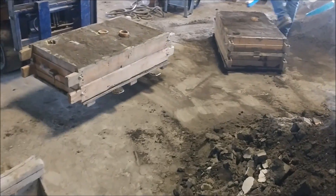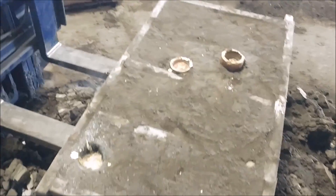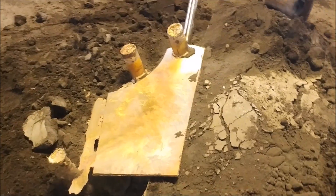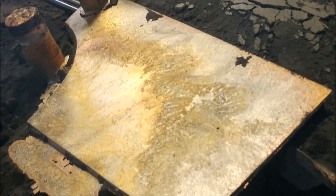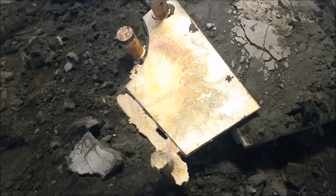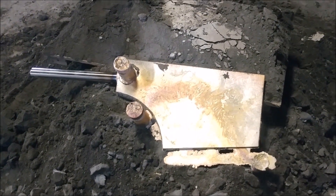Here comes our rudder over to our shakeout pile. We'll crack this guy open and see what it looks like. We just shook out our rudder and it's still smoking hot. We're going to let it cool down this afternoon and start working on it tomorrow. It's got a little different coloration on the surface but it's all nice and smooth — that'll come out with a little bit of buffing. The next step is to cut off the excess — this stuff here, that riser, that riser — then buff it out and get it polished up looking like a nice brand new cast rudder.